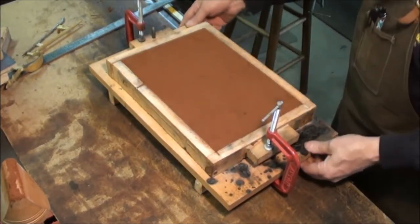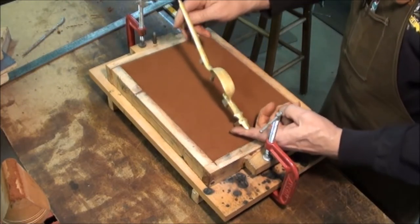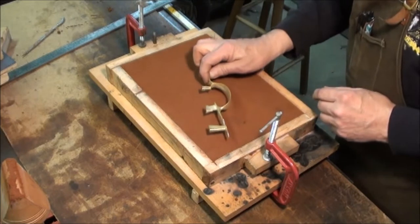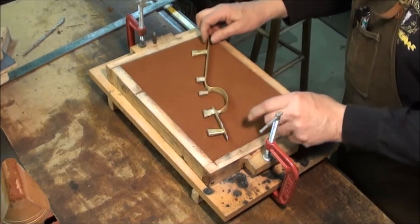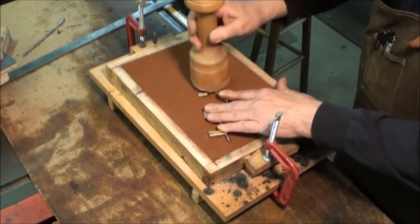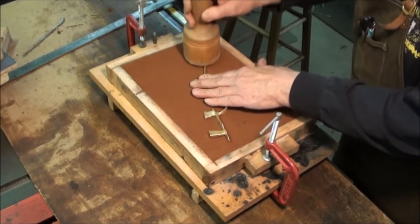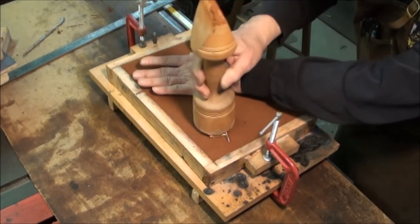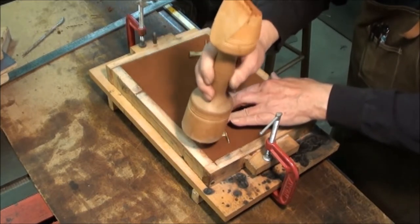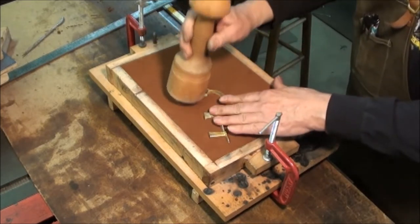There, looks pretty good. Now, since this is just a one-off mold and this is the trigger guard I'm going to do, I'm actually going to cast this one in silver for a fowler I need to build. So we just lay it on there so that we've got it pretty well centered. You want to tap it in about half the thickness, that way your points will be even with the level of the sand.